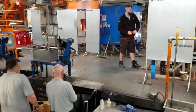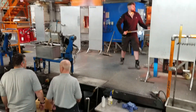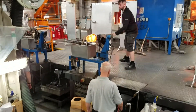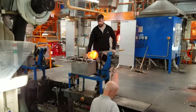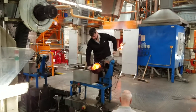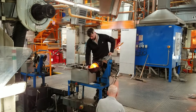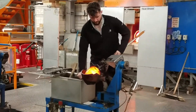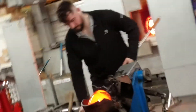He's heating the piece there now. The craftsman removes the molten crystal piece and will insert it on the third table you see here in front. He will shave the molten crystal piece with the hand-held wooden tool. At the moment the molten crystal piece is orange in colour, and this is because it's still hot.